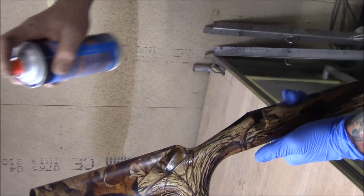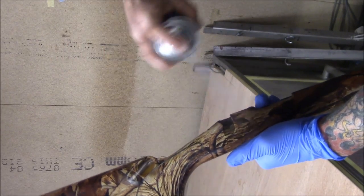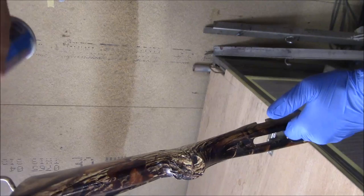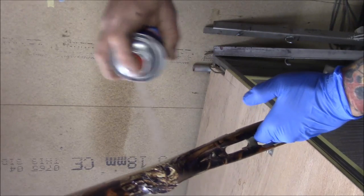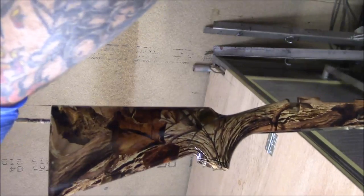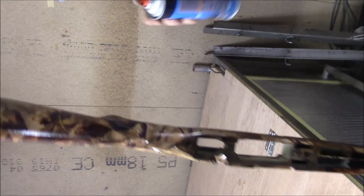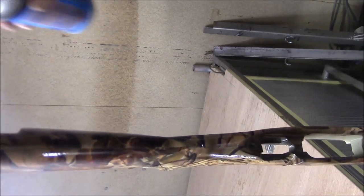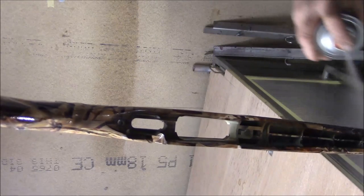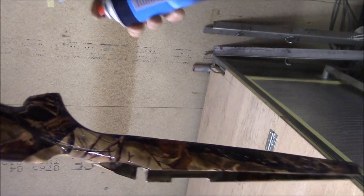Right, so done that now. I've got my fan pattern, heavy coat, just one. It's only a demo, this. As with the primer, I'm aiming for an extremely shiny, gloss-like finish, just with the coats that I'm doing. Not interested in what my hand's doing at all. I'm looking at what the actual paint's doing on the surface of the gun or the stock. Nice slow coats.